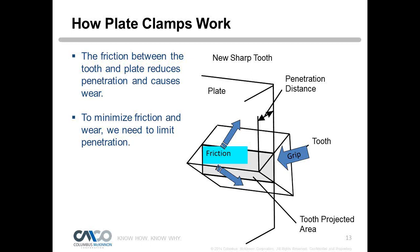Yeah, that is a very good question, because typically in rigging you see the max loading of that clamp, and we just got done telling you that there's a minimum loading. So yes, CM does stamp the max working load limit you should utilize for that clamp, and the minimum working load we do stamp on the side of our clamp. So we do have that.